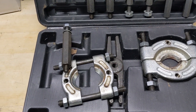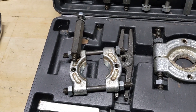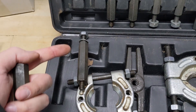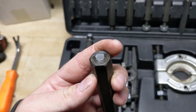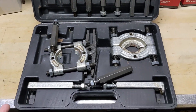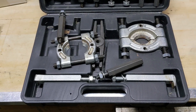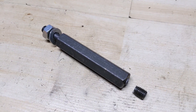The split puller may not be enough to get a seized bearing off a shaft, and usually you're going to have to apply some sort of heat. If you don't, you could end up breaking the threads off your puller — like you see right here. These are just cast, not forged — this was something bought off Amazon, so it's a Chinese brand. Breaking one of these tools is what can occur if you don't heat the object you're trying to remove, so the split puller won't have to work as hard and there will be less stress on these upright pieces.